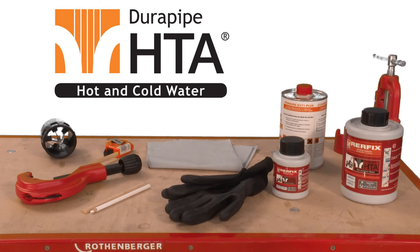The equipment you'll need to perform reproducible jointing of DuraPipe HTA includes a pipe cutter, chamfering tool, tape measure and pencil, DuraPipe HTA RearFix solvent cement, cleaner, and solvent resistant gloves.